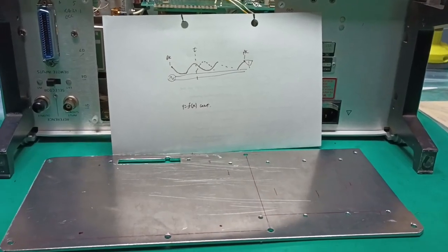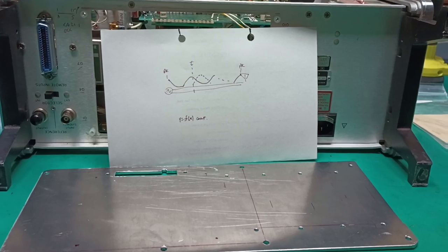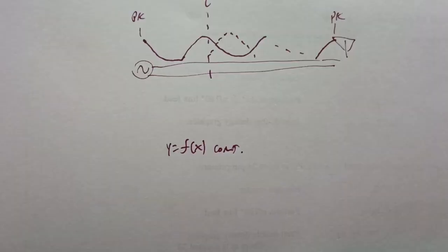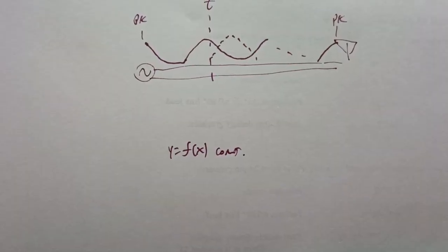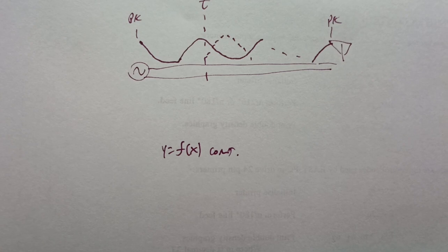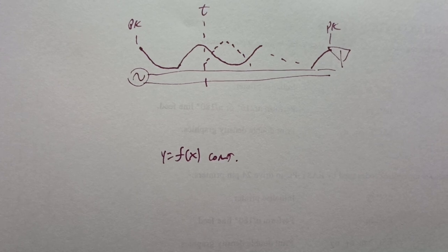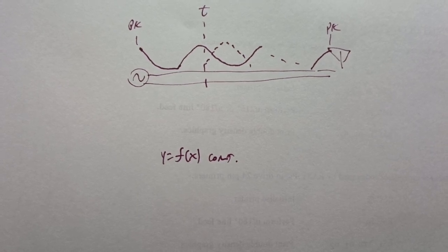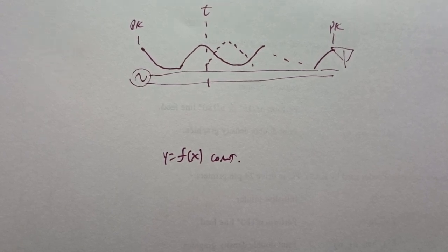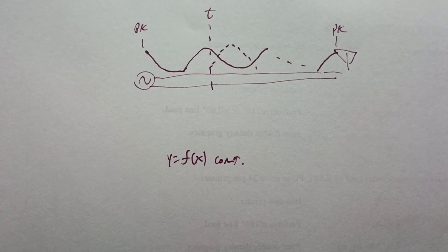So the ratio then is the ratio of, at that point in the line, the forward RF current versus the reflected RF current. The goal is 0 reflected RF current. When there's an antenna feed point mismatch, and there's a significant amount of reflected energy, enough that there's a reading possible at the transmitter over the transmission line loss. If it's a few tens of milliwatts, there may not be enough surviving back to the transmitter to measure, and it doesn't make any difference. That's trivial. But if there's a lot of mismatch, then the length of the line becomes important,